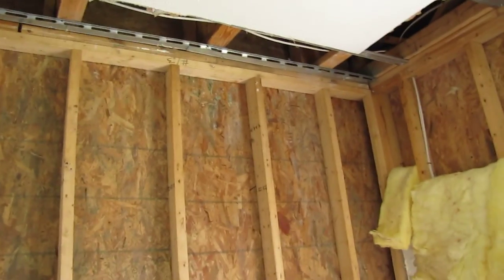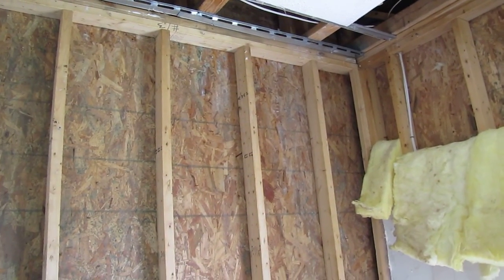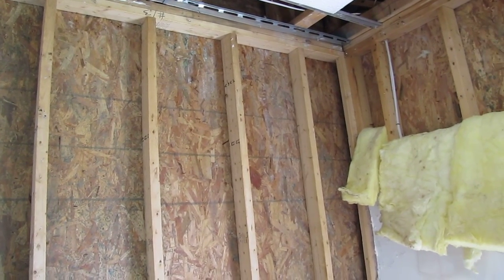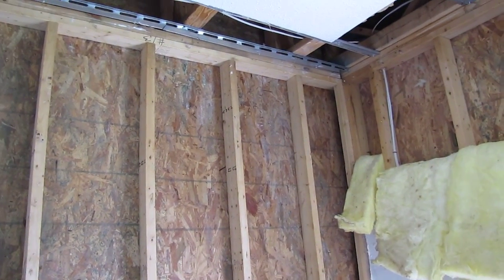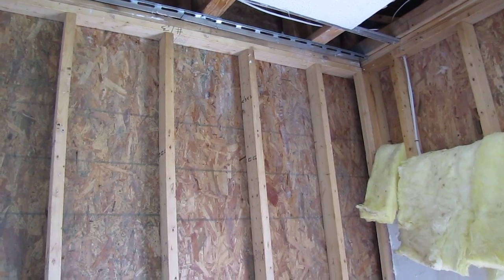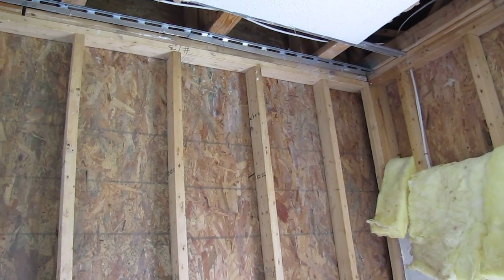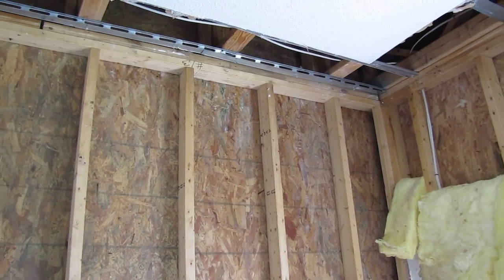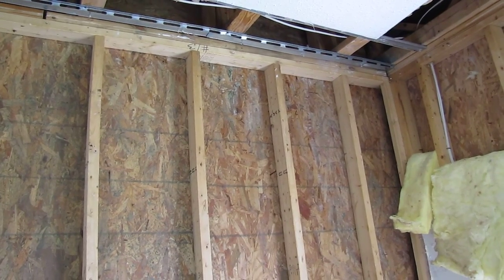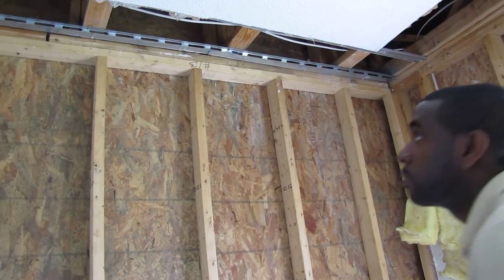Now, let me read it. Remove the exterior siding for back side of the building. Install new siding. Replace all damaged plywood. Install new treated plywood with one side vinyl coated. Replace the double top plate studs and install new. Remove all metal grip connections and install new. Install building wrap paper for exterior walls.